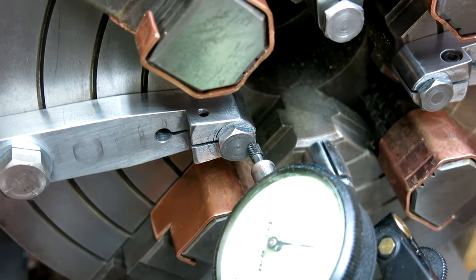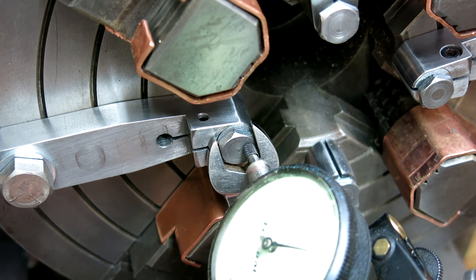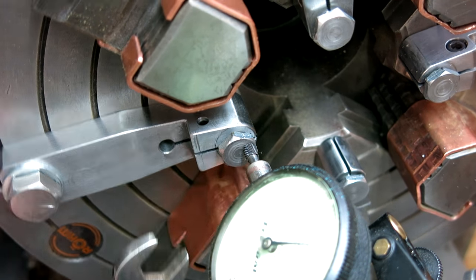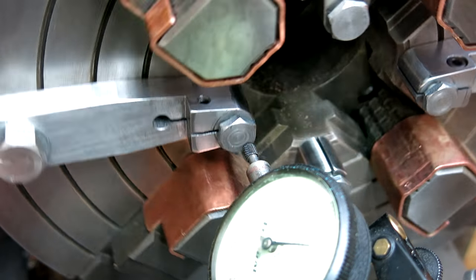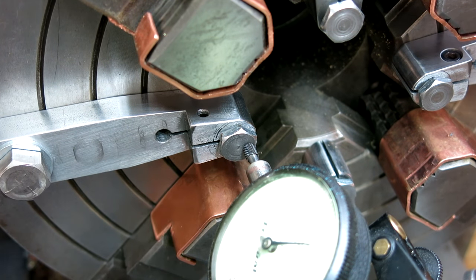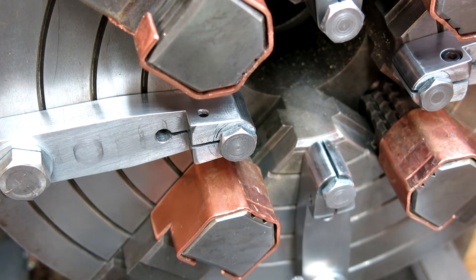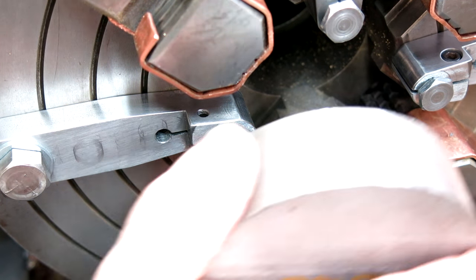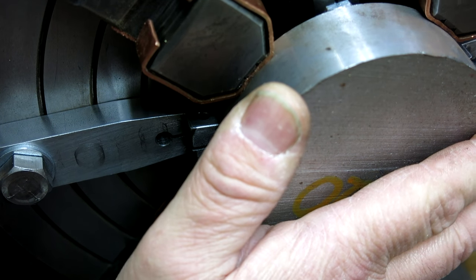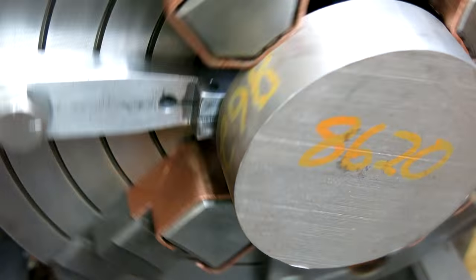Or that face is parallel — perpendicular to the axis of rotation, which is really what you care about. I'm adjusting these back in. That one needs a little one. It's really easy to set them to within a mil really easily. And then now I can just plop my discus maximus in there, and I've got a nice solid backing to push up against or turn against.